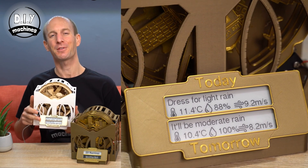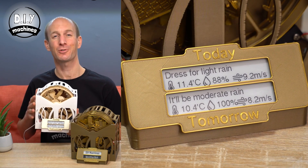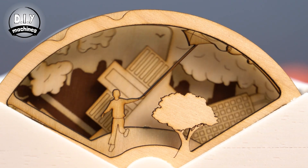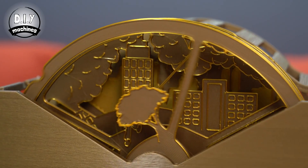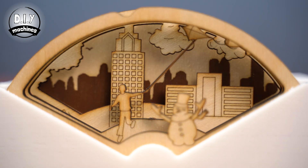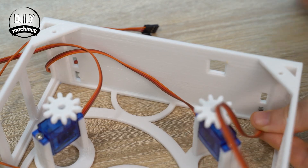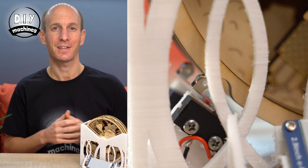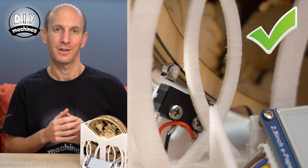The idea here is that you get your weather information two ways. On the base, an e-ink display gives you the practical info for today and tomorrow's forecast. But the real showstopper is the weather scene created using a stack of four plates. These can be either 3D printed or laser cut, and files are included for both. Each plate indicates a different aspect of the weather, including rain, wind, temperature, and cloudiness. The plates are spun using servos and gears. The really clever bit is how each plate includes notches that, when combined with an array of roller-style limit switches, provide the microcontroller with an awareness of what scene is currently being displayed on each plate.